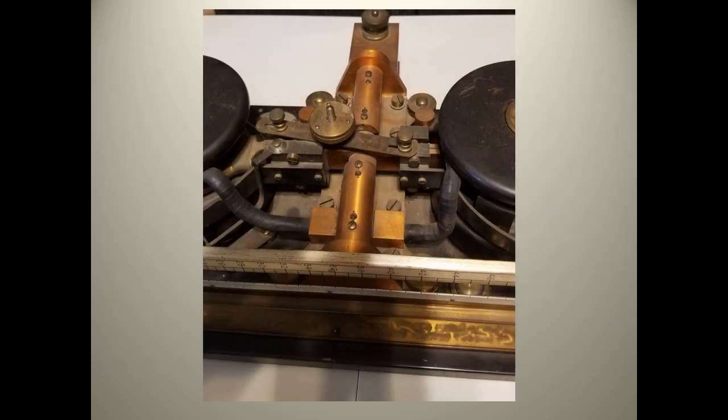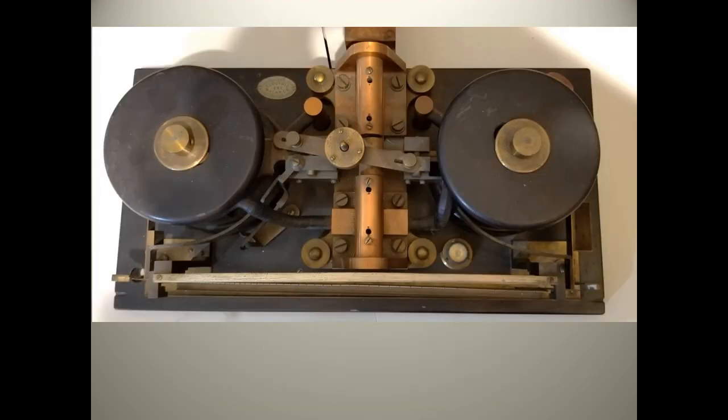Current is applied through the copper connections at the rear of the meter. The coils and discs are actually on opposite sides of a balanced beam. The heavy coils are wound such that on applying a current, the magnetic field pushes one disc up and pulls the other down.